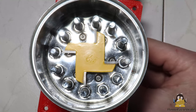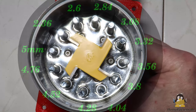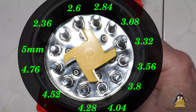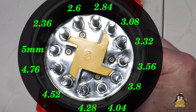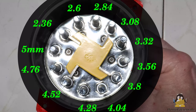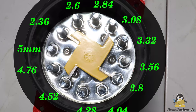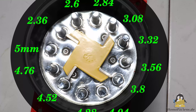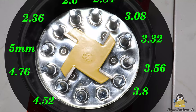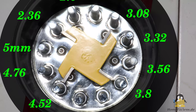This is the reason why the stator screws are arranged in a spiral. With this, gaps of different sizes are formed between the stator and rotor. Since the pellets become smaller and smaller during the grinding process, there is always a gap somewhere between which this particle can continue to be clamped and thus shredded. Grinding is a statistical process — which particle gets between the plate and the stator, when and where, is determined by chance.